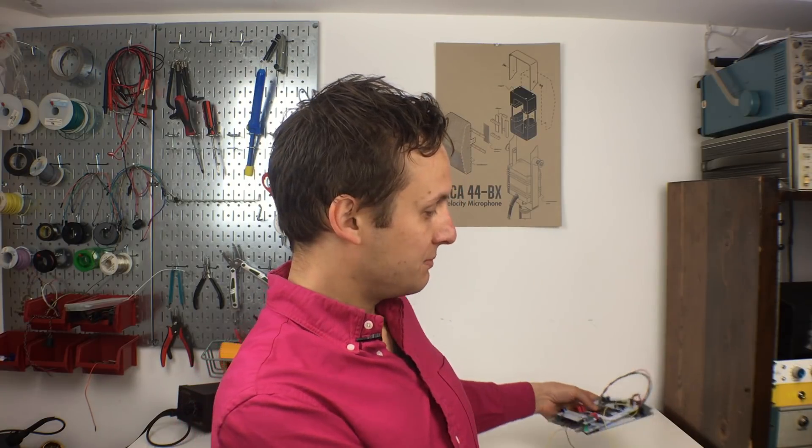So those are the added features: a DI, a line input switch, a dry output, and an extra color socket. That alone would be an extremely full-featured, very versatile preamp. I've done some preliminary board layout and from this first prototype it looks like we can fit two of those in a one rack unit rack — so that would be an awesome stereo preamp.